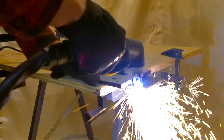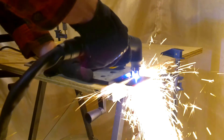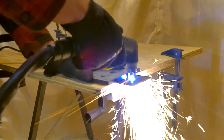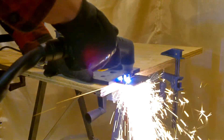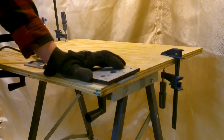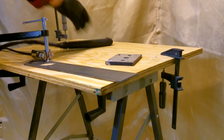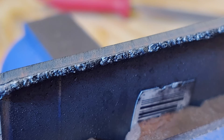So far I've only cut 1/8 inch, 3/16ths, and 1/4 inch mild steel. I have cut a small piece of 1/4 inch aluminum and that cut pretty good. This unit did come with an adapter to go from 110 to 220 so that you can plug it into a 220 outlet. I have used this adapter and used the unit on 220, and it cut pretty good — no different than how it cut on 110, but again that was only on thinner metal.